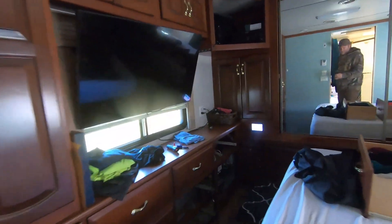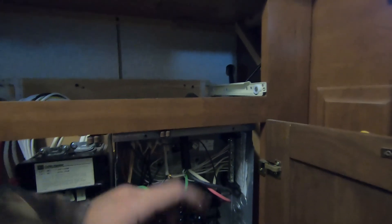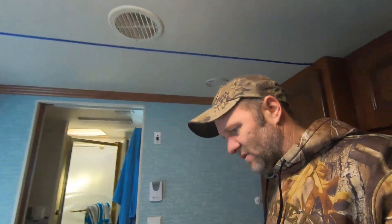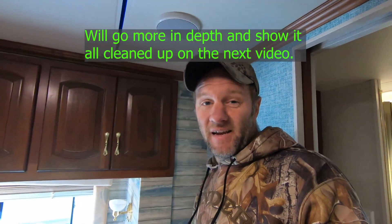Back in the bedroom — I'll show you: the room's torn apart but the lights work. This is where we installed the touchscreen and here are the breaker panels. This is the main panel and this is a 30/20. I connected the 30 because it previously ran down to the inverter — now it's connected directly to this panel to run the secondary panel, giving it 30 amps while the main has the full 50. Hopefully this video wasn't too long and showed the basics. This is only my second install. Next up we're going to do solar on the roof — I still need to figure out how to run it down. Until next time, keep bringing your dreams to reality.